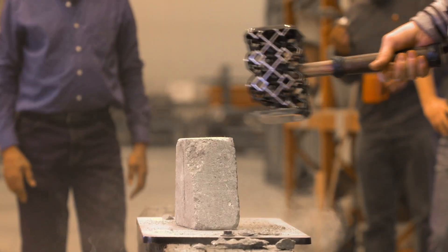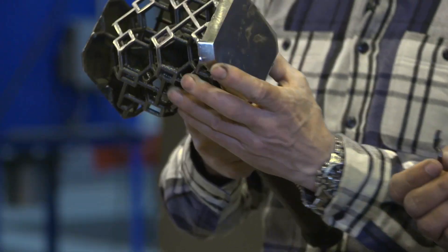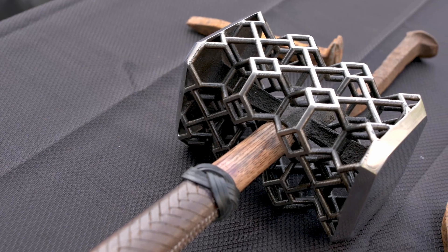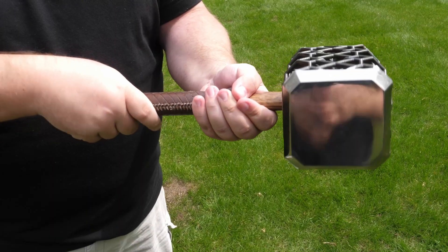It did, however, let go in a bunch of places up here. This is, I think, a combination of perhaps ductile and steel for the faces. Ductile is a pretty durable material, but in this case the dimensional lattice wasn't up to snuff. Beefier would have been good. We gave this one the award for most intricate casting, and it just could have used a little more strengthening — a little beefier in the lattice.